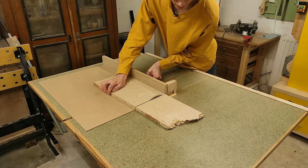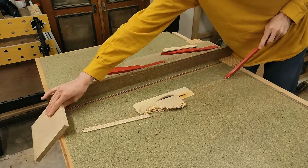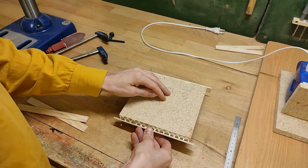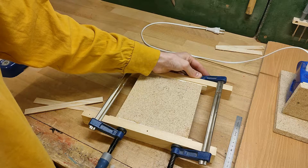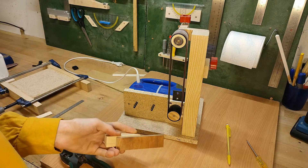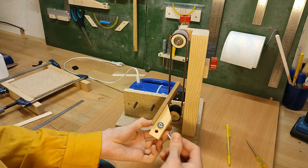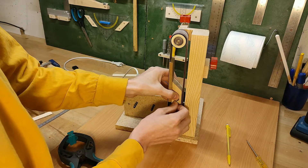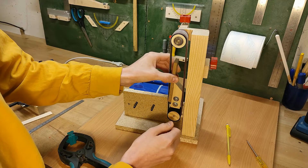As you can see, I'm cutting the table out of the same crappy salvaged chipboard I used for the base. Since uncovered particle board edges are about the most ugly and inconvenient thing that can happen, I'm adding some simple spruce edge banding to prevent chipping. That obviously doesn't apply if you use plywood or something else for the tabletop. While the edge banding dries, I'm gonna go ahead and install the skid plate. We're gonna need two bolts with a washer and they just slide into these oversized holes and screw into the tapped holes in the steel plate.